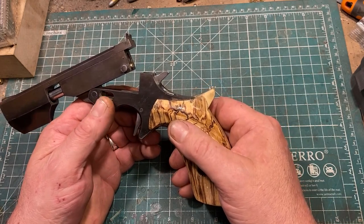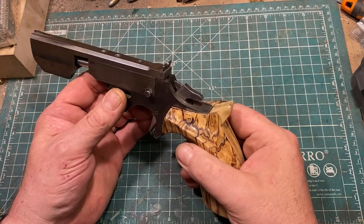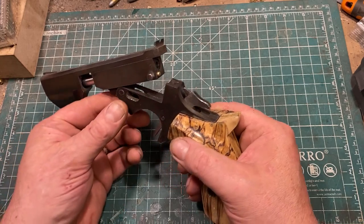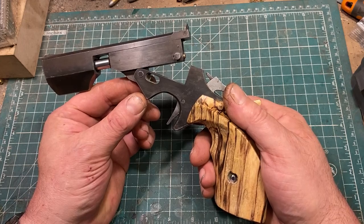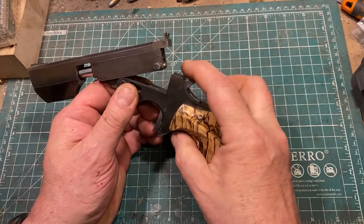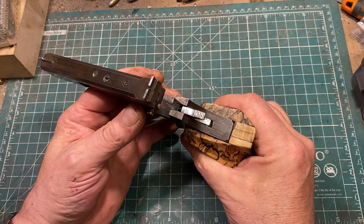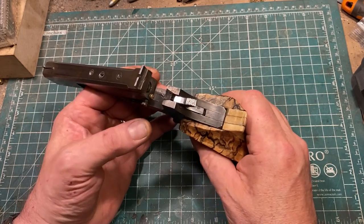The spring is one I made myself, and I did not get the geometry exactly right, so cocking it — there's no positive click when the trigger engages. As for the trigger, I always dry fire it with the mechanism open so I don't hammer the firing pin into the back of the chamber. Let's say you don't want to touch that trigger until you want the gun to go off, because it breaks at about one pound and is very crisp. So even though you can't hear it engage, it does hold things securely until you're ready to fire, and there is a safety notch that is very robust. I doubt you could drop this under normal circumstances in any way that would overcome that notch and cause it to fire a cartridge.